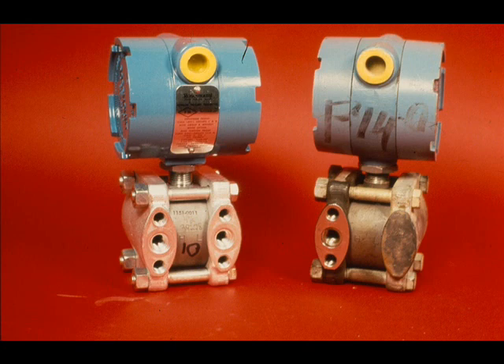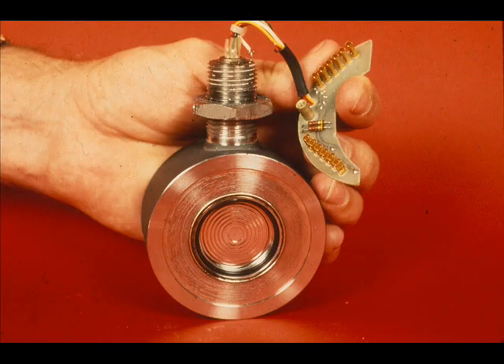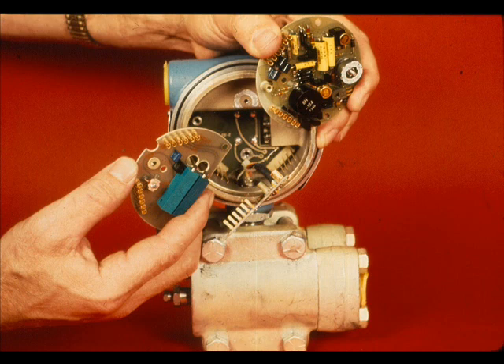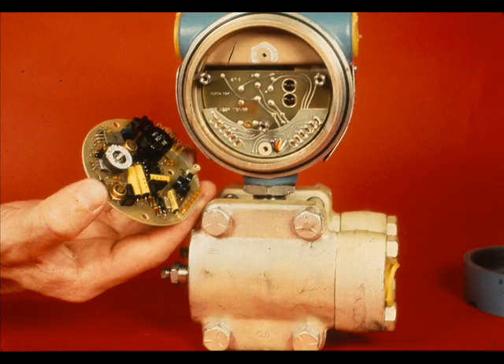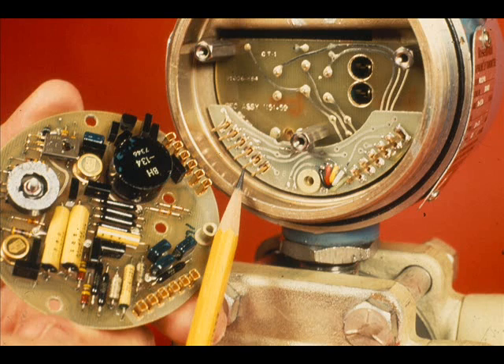Exclusive of the impulse piping and the signal wiring to the control center, the Rosemount transmitter can be divided into four basic components: the sensing element, the amplifier board, the calibration board, and the connection board. These boards are located in the circuit compartment. We have already shown how to check out the sensor module. If the isolating diaphragms are dirty, they can be wiped with a soft rag — do not use any chlorine or acid solutions. The best way to check the circuit cards is to replace them with ones known to be good. When there is trouble with the output reading, make sure the pins are all making good contact on the circuit boards.